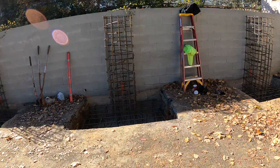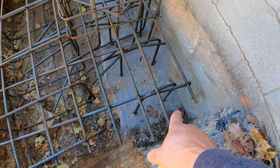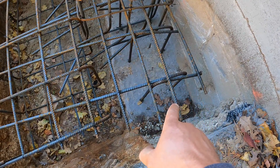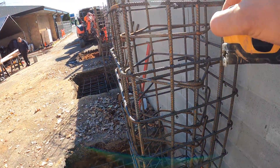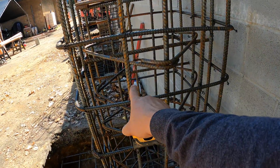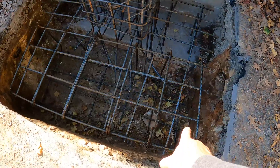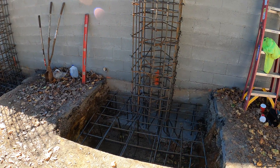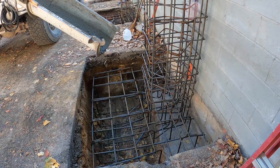So far we have our three pillars and footings dug, rebar cages in and ready to be poured. We have rebar doweled into the existing footer — 12 pieces of rebar doweled in, spaced every 12 inches, and then there's 10 of them going into the wall. The cage has about 10 outside rings, 10 inside rings, 16 uprights that go down and spread out into the footing, and the footing has its own rebar cage. Concrete truck is on its way — we're going to pour the footings first, then in two days we'll form out the columns with wood and pour those.